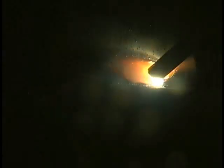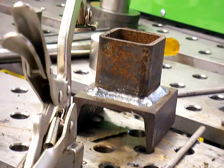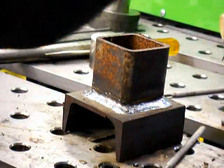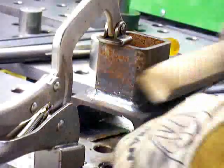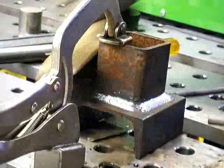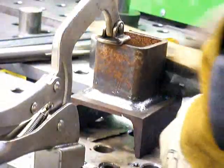That was a start where I kind of missed — I wanted to start about a half inch back but it slipped and came about an inch ahead. But as long as I'm re-welding over top of all those arc strikes, that's okay. You always want to strike your arc in a path that you're going to weld over top of your arc strikes. Arc strikes are bad — they will fail you on a welding certification test. They look bad and they actually are a problem, especially on high-strength steels, because they're a stress riser and a crack can start where an arc strike is. Arc strikes are usually very hard and brittle because they heat up and quench so quickly.